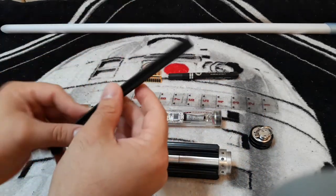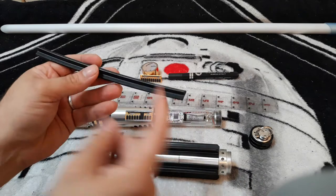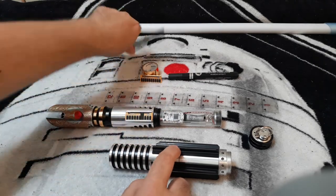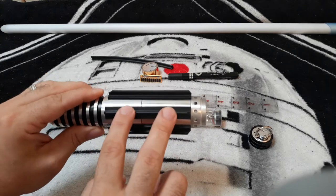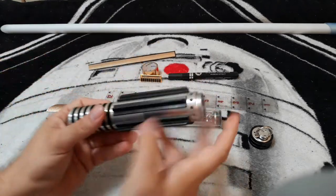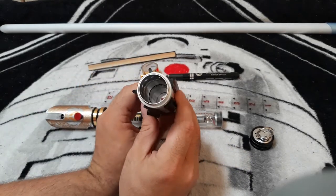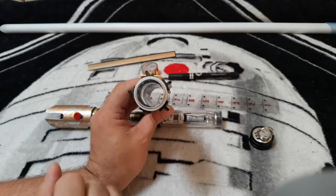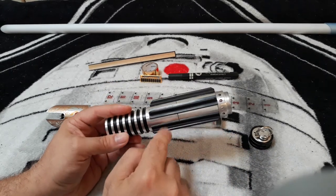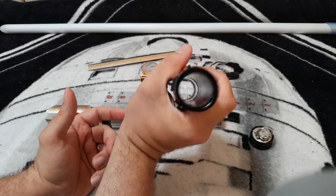From the Custom Saber Shop I bought a two-foot length of this T-grip section — you just cut it yourself and it sticks on. Although I didn't just use the included 3M adhesive — I actually scratched up the surface of the aluminum where the grips were going to go, and I super glued them on. I also took a hobby knife and scored the back of the grip material, because this is where you're going to grip, so it needs a lot of surface area to really hold. These are not coming off. Instead of doing six or seven T-grips — I've seen some where they'll have six or seven — I decided I just wanted to do five. That gives more spacing between the grip and the saber itself, so you see a little bit more of that silver come through, and my fingers fit in there fairly well.